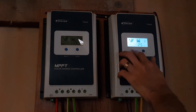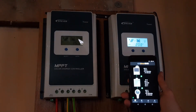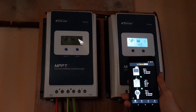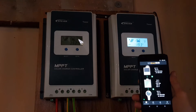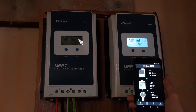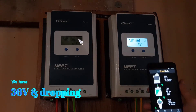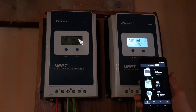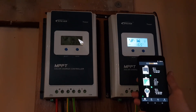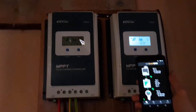Let's try to get a little record — oh, there it goes, it sags down already. Look: 44 volts, then 40 volts, 39 volts. The weather is the same, it isn't changing, it's full sun. The average is dropping — 36 volts, still going down. This should be tracking and holding the MPPT voltage, but it's not doing that. It's just going to sag down to 15 or 14 volts and stay there.